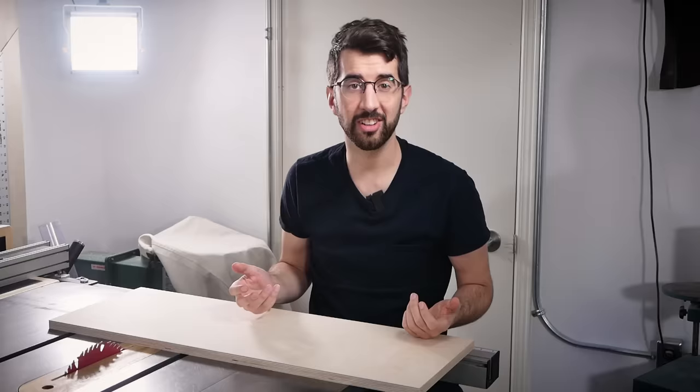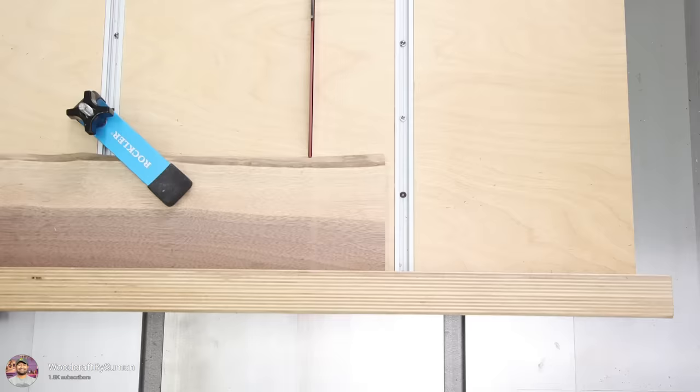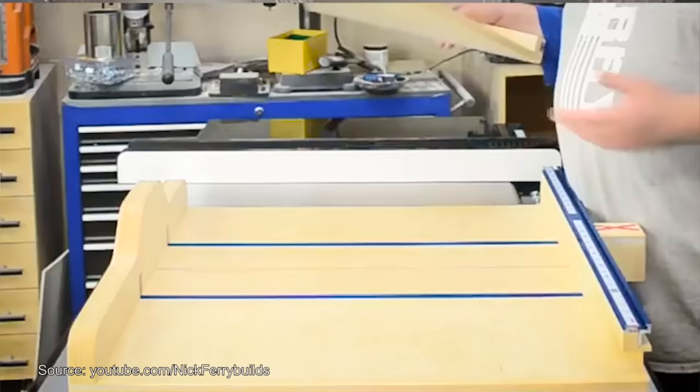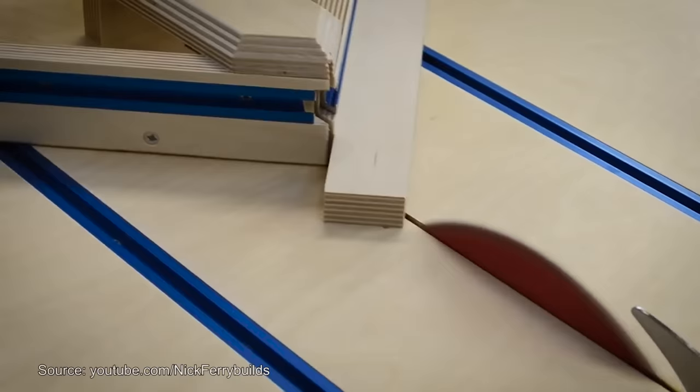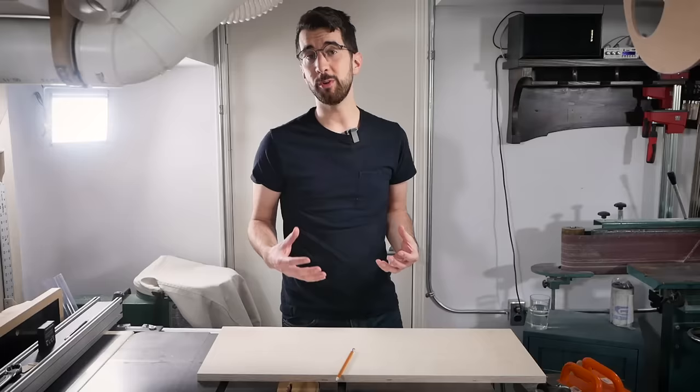You might also want to crosscut something very long and to prevent it from tipping you can secure it using hold-down clamps as well. You can also use T-track in your base to expand the capabilities of your sled with modular components like adding a miter attachment. I'm more of a fan of keeping separate jigs for separate functions because it's simpler, quicker, and potentially more accurate in use — so I won't be adding T-track to my sled base.